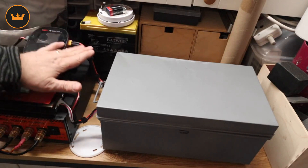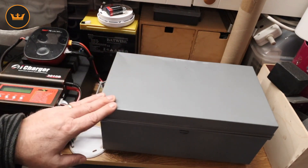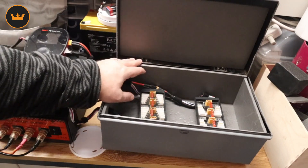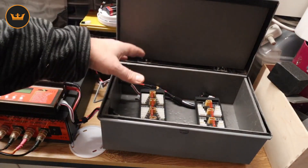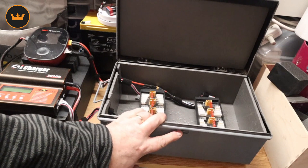I've created this — I've got my iCharger in the house but I've also got the ISDT T6 light. I've had this iCharger 3010B a number of years. I had this — I don't know whether it's an ammunition box or exactly what it was — but it's a tin box. And what I've done is in this tin box I've lined it with Depron foam. Obviously if there was a fire in there the Depron foam is going to melt and deteriorate, but I wanted to stop the box getting too hot. So there's Depron foam on the base and around. If one of these combust in there, then pretty much everything in there is trash, but it will stop the heat and the smoke and the flames coming out of the box. There's a little hole which I've cut, slots to allow smoke to come out.